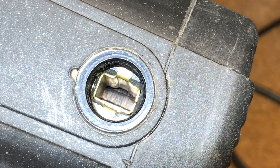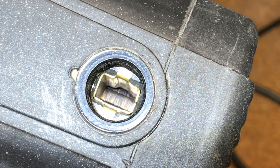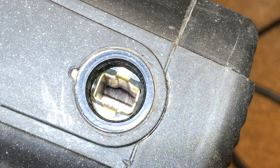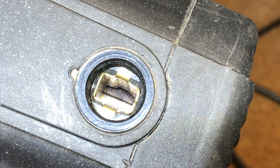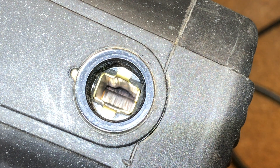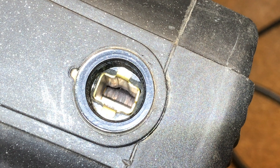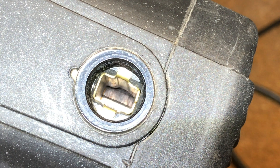If I can get that out and tidy it up on the lathe, that's going to be quite good. I thought this was a direct drive to the blade — it may not be. I can rock the blade backwards and forwards with play between the blade and the armature, which possibly goes through a gearing mechanism. I'd expect a little bit of backlash if that was the case, but I wouldn't expect an armature to look like that and expect 100 hours life out of a brush. Either way, that armature's coming out.